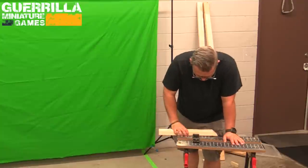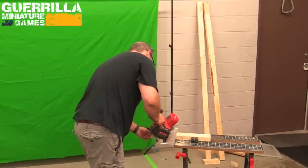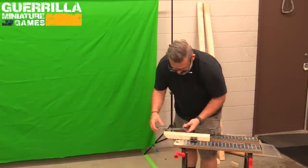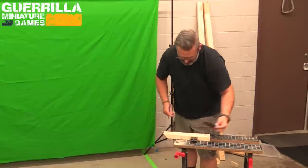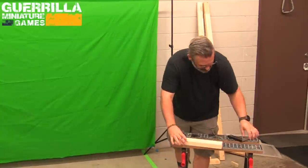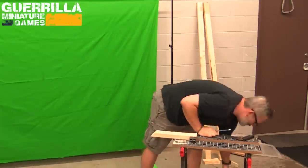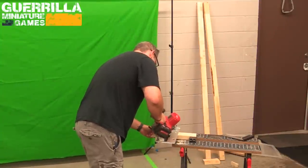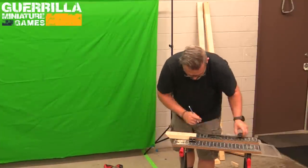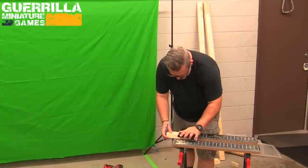Here I'm cutting the 45-degree angle for the braces, double-measuring because I'm paranoid about cutting wrong and having to go get more lumber. When you're using a fixed amount of material you get very careful about measurements. This is just the boring part of cutting all the wood and getting the feet made, but if you want to make a brace for lighting or basically anything, it's super easy — a circular saw, a driver, and some construction screws, and you can build damn near anything.